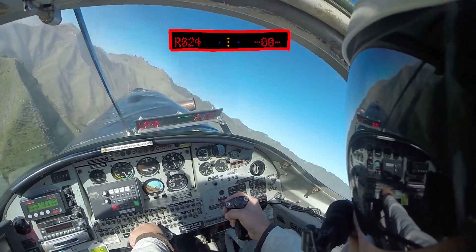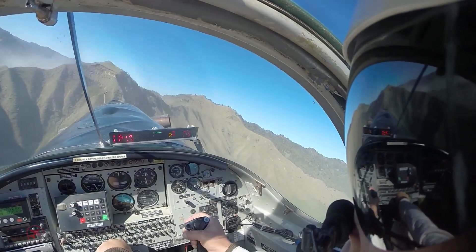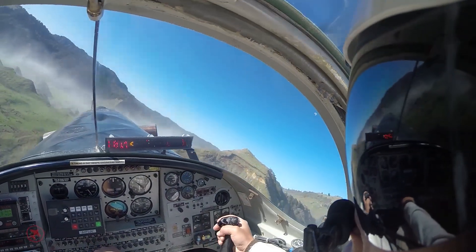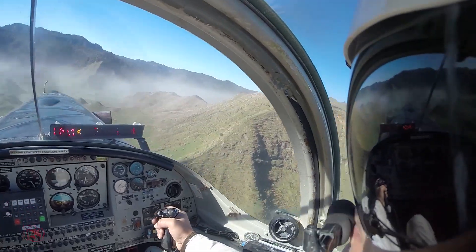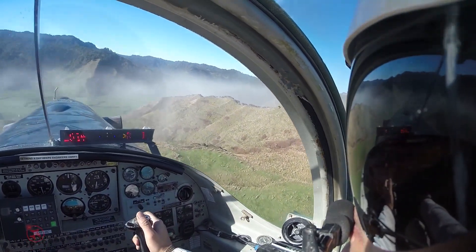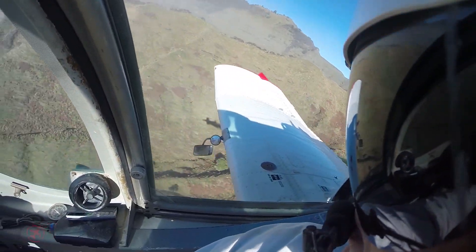The number on the left is the current swath number, and blue lights mean our doors are open. We turn onto our block using the light bar as a guide. The ridge is our starting boundary. Cross the fence, opener up. Blue lights are on, so now our hopper doors are open. Have a look at our wing mirror to confirm the spread is flowing nice and freely.